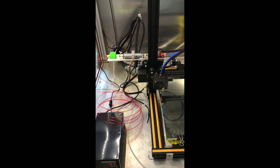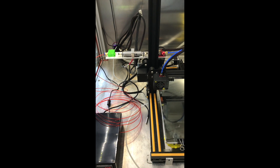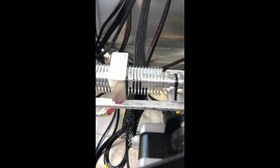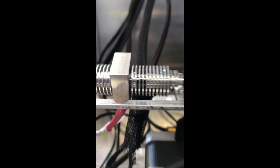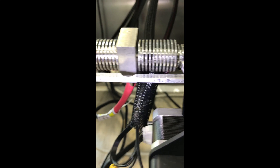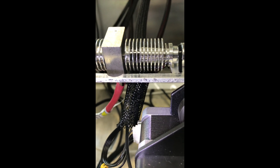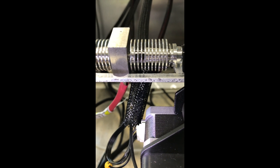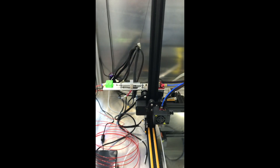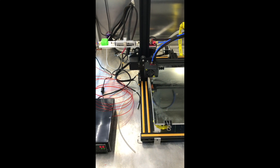One thing to add — I've been asked this question a few times after posting on Facebook — people wonder how the water vapor can escape when this thing is heating. If you look closely at the heat sink here, there are actually some holes that have been cut. Your filament passes through here to your heat lock, and on its way out, if there's any moisture, that's where it would be allowed to escape. Anyway, that's my review — I'm happy with the product.